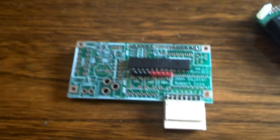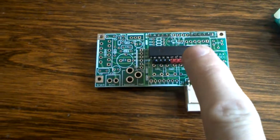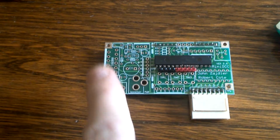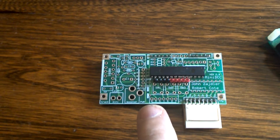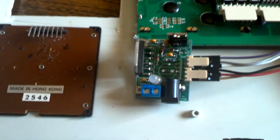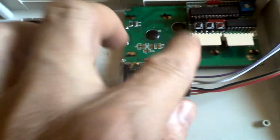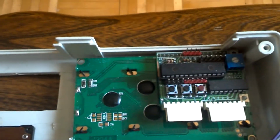What you see here on the right side is the DCC circuit board, the brains of the operation, with this CPU chip. And on the left side here is the booster section. It's a tiny little guy, and there's a dotted line there, so you can cut that and separate that board. This is a fully assembled little booster, and you have the bar connectors. You add these little wires, then you can connect them back. In this case, this is the board that it was cut from.